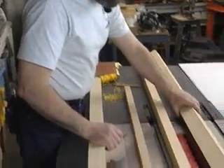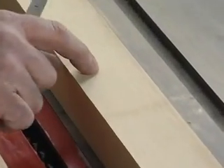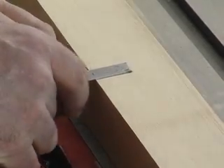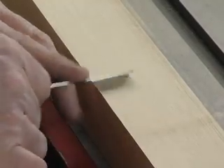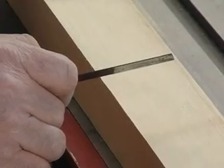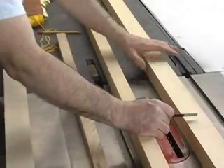This is our faux spar that we've been using from some of the earlier lessons. I want to show the fine grain on this wood — it's an exceptional piece. With a little metric ruler, if you start counting the growth rings, you can see we're way beyond my normal 10 or 12 per inch. It's an exceptional piece of lumber, very fine grain, very slow growth. This kind of wood is hard to come by, and the whole piece was used to make the spars for our Curtis Jenny.